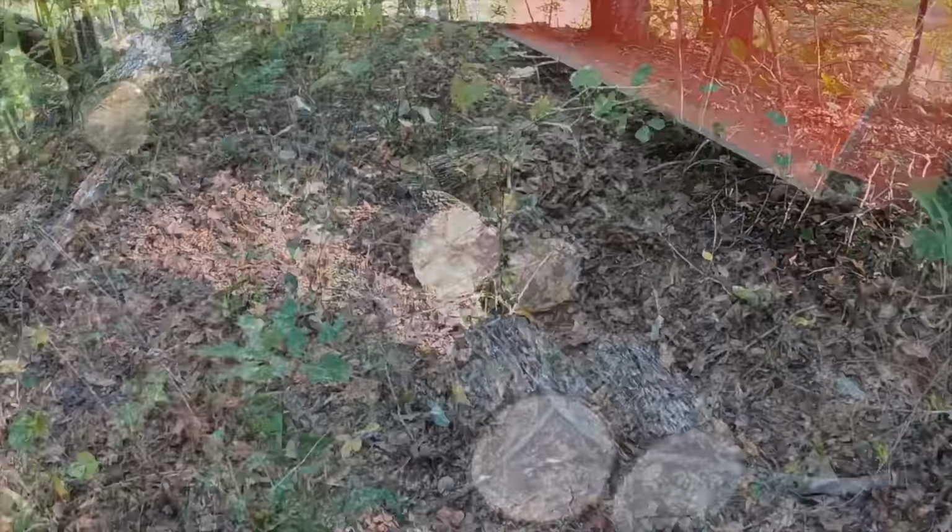That's some nasty stuff, and it only goes down these two liners right here. So thankfully it doesn't go all the way to the bottom. The bottom two liners look pretty good, but these two right here are looking pretty bad. So here's what I've done. I've taken a hoe and I've sharpened it, and I'm just gonna see if I can scrape off that glazed on creosote right there.